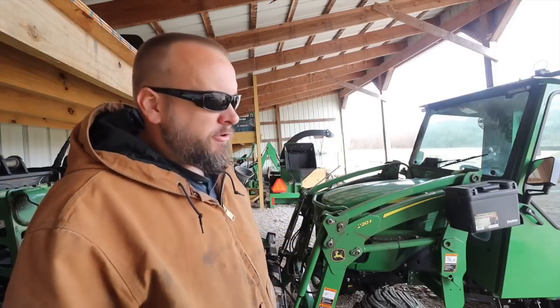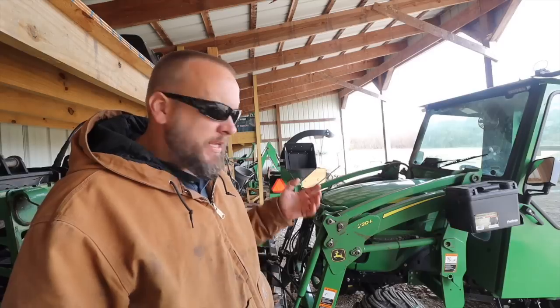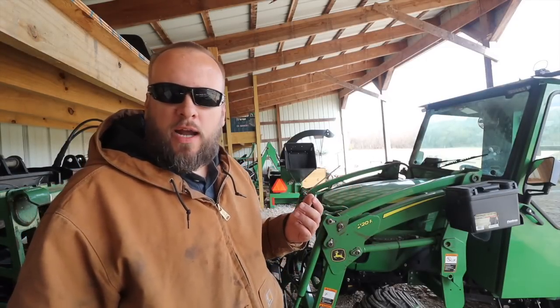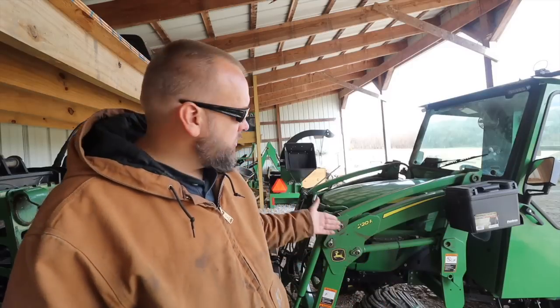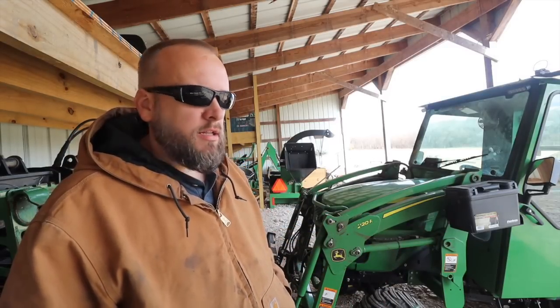Second thing is you've got washers on some of these pivot points on the self-leveling loader. After 100 hours running the self-leveling loader, some of those came loose and I had to take it in. Well, I could have done it myself. I understand what to do, but it's under warranty and that loader was new. So I just took it back to the dealership and had them fix it to make sure it was right. They replaced the washers that go behind the bolts and they Loctited those. I have a separate video just on the issue with those bolts coming loose in the loader.